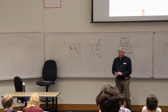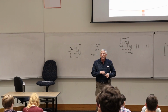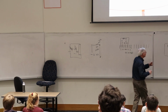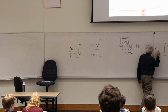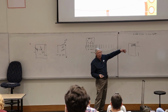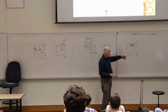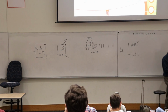Well, what do you think? What are some things we have to take into consideration when we look at those limits? 3.3 volts. Okay, so you kind of stumbled into one of the answers there. So what is our VDD? What's the voltage we're running the chip at? That actually has a lot to do with what the levels that define zeros and ones are. It also turns out we have a register that changes the function of these inputs from TTL to Schmitt trigger. And Schmitt triggers have a different level. So we have to go to the data sheet.